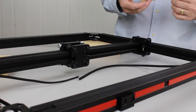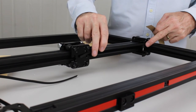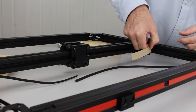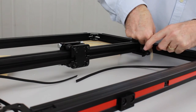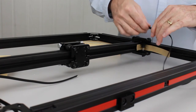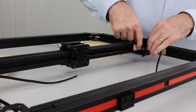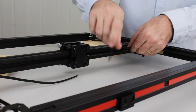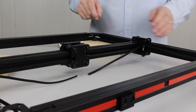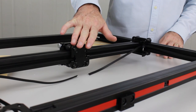We're now on the last pulley. Feed it through the pulley and over to the back of the X carriage — again using a piece of card, inserting it behind the pulley and following it with the belt, making sure the belt's not twisted and passes between the flanges of the pulley. And there we have it. Next, we'll move on to attaching both belts to the back of the carriage.